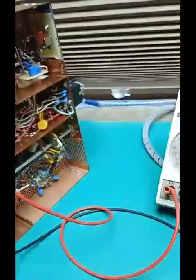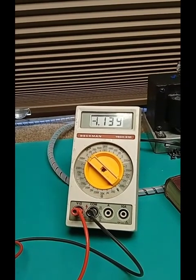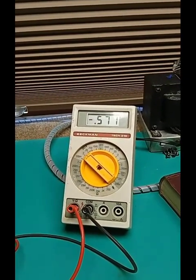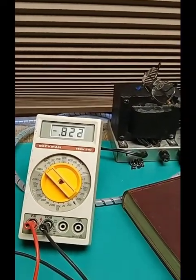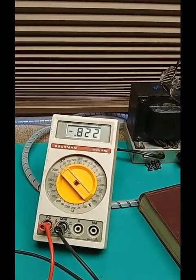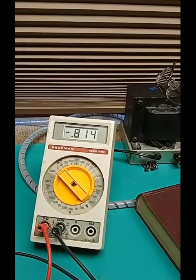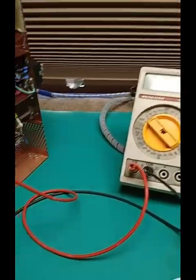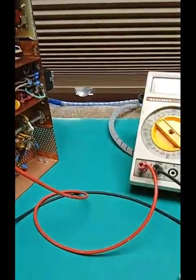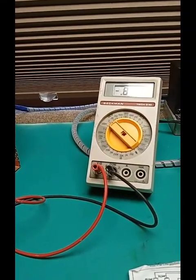But now I'm going to try the bottom slug again after running the VFO up a little bit. Get 3 decimal places. Check the bottom again. Just turn it one, oh, wrong way. Okay, that was at peak. Do that a couple times, let it rest in between each time. That's necessary for all these alignment adjustments.